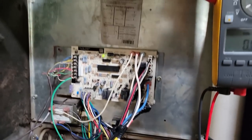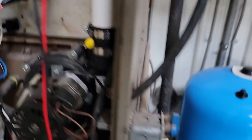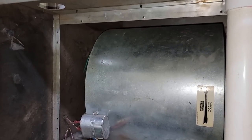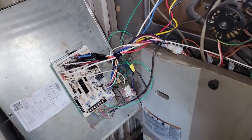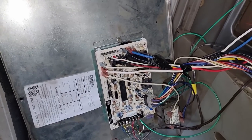When I come back to change the board, I'll pull that blower out and wash the blower wheel - or take a quick look to see if it's actually dirty. I always love the way they design these because you have to yank out all this crap to get into it. We looked at the blower wheel on both sides - there's not a whole lot of room in there - and it's clean. I'm going to tell them it has a hellacious vibration, which means it's probably going to take out the motor next. The whole furnace should just be replaced.